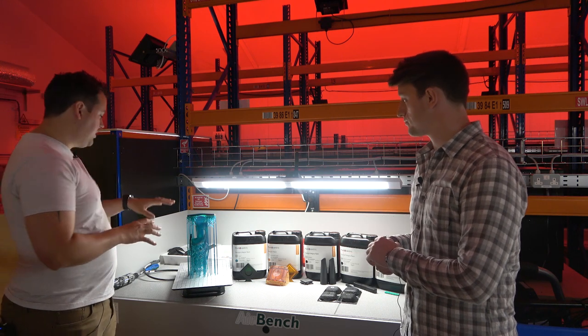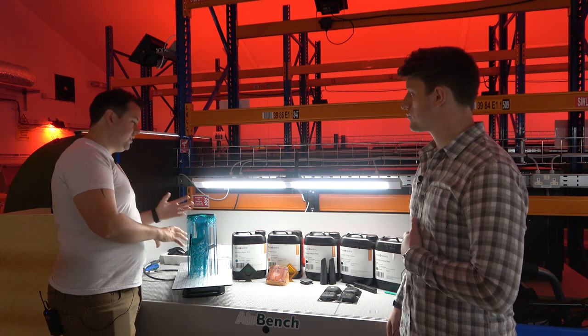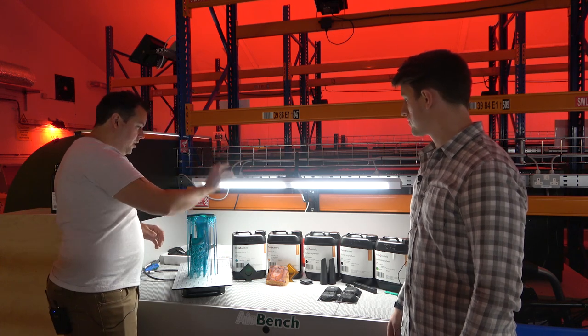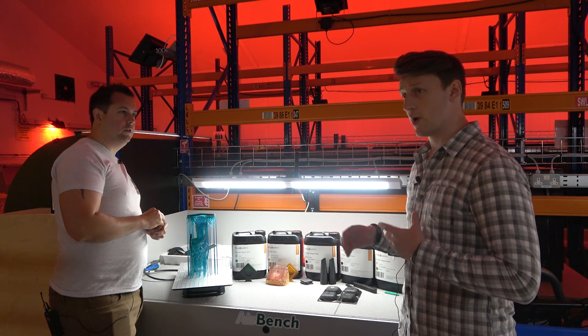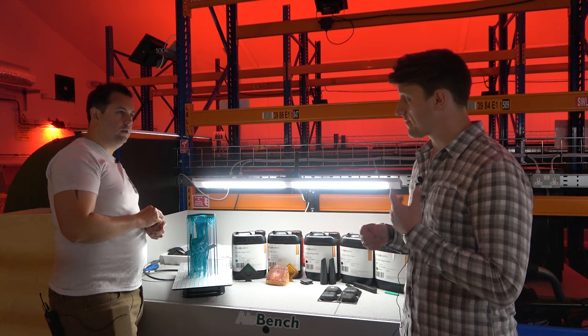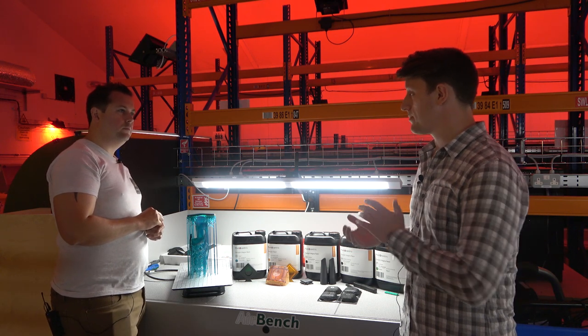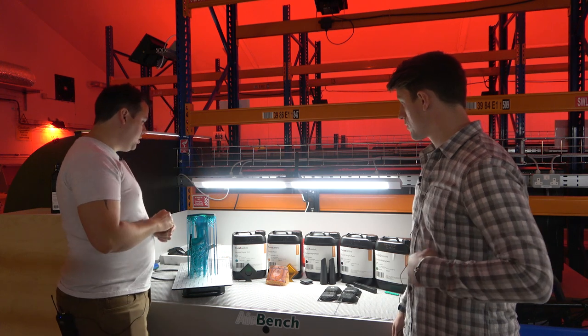It's more designed for fluid chambers and for the prototyping of concepts rather than functional end-use parts — not necessarily mechanical parts, but certainly fit and fitment, so you can initially confirm the right size and then move on to something like the high temp or the duramax. Due to its translucent nature it offers a turquoise finish, which is really beneficial for fluid chambers where you need to see the movement and flow of liquids.